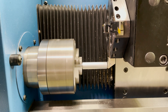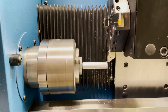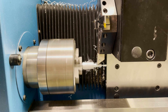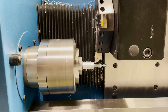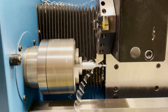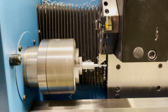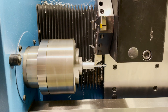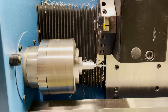I could see already something was odd about how this was cutting. This should have stopped in the center of the bar and it went all the way to the very end of it. I've skipped some of the cut in this first pass to show you what went wrong. It seems to be cutting properly in the Z axis but on the X axis it's cutting way deeper than it's supposed to be. It eventually fails as it's just cutting much deeper than I anticipated.